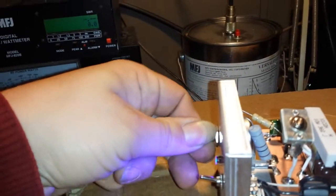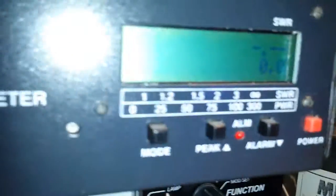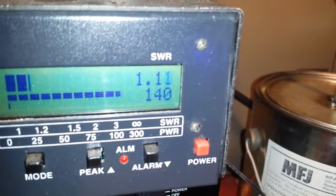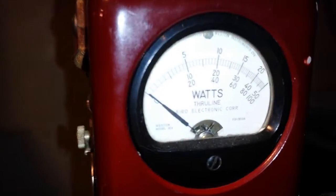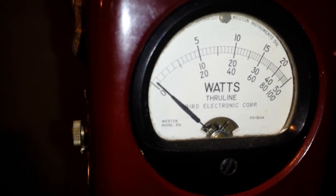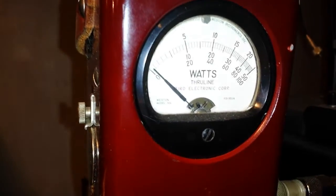The variable's turned all the way down. I don't have a knob on it so I can't see what halfway up is, but we're just going to go from all the way down to all the way up. We're getting audio. About 140 watts. To show you the reflected power — we're on a 10-watt scale, so the 100 is 10 watts, the 40 is 4 watts, the 20 is 2 watts. In between that is 1 watt — virtually no reflected power whatsoever, just the way I like it.